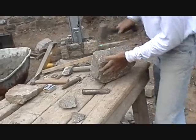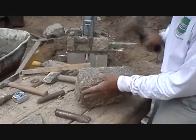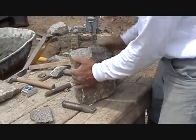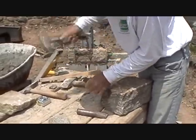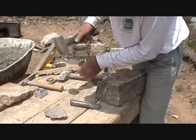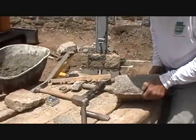Just to straighten it out. You have the corners — you want this face straight up and down. That is facing a stone, or some people call it dressing a stone. You want to get a knife out of it — there's a knife here. You get the point of the chisel and you put it like this. That takes the knife out of it. This is granite — every stone is a little different. That is how we flatten our stones off.